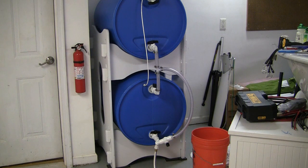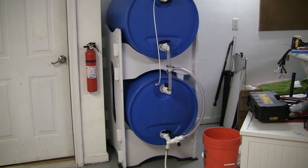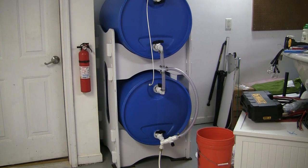I tested the top barrel first before I did the bottom barrel, so I didn't waste as much water. I got the top barrel watertight and then moved to the bottom barrel. Another tip: leave the valves closed that interconnect the barrels so you don't have a lot of water pressure in that clear tubing generating leaks. Once filled, close those valves. If you need to transition water from barrel to barrel, open them only for those purposes — that way you don't have continual pressure running on those hoses and fixtures.